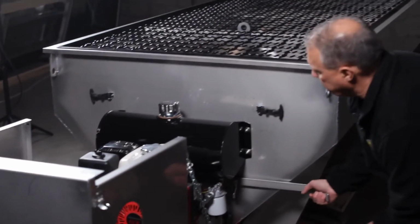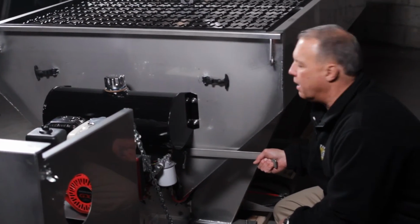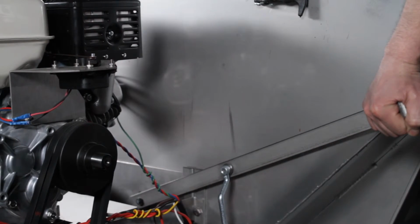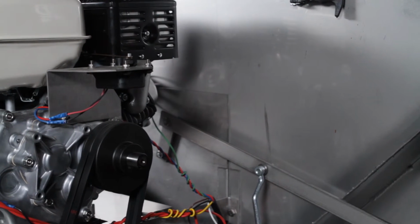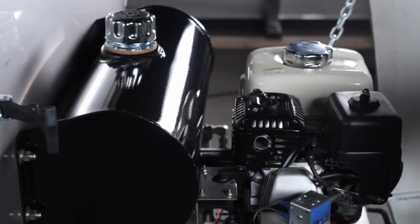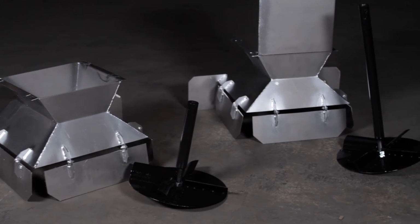As part of the hopper assembly, we include an adjustable gate to the rear of the hopper. This allows for just a release of the lever nut and an up and down motion to either close the gate for less material flow out the door to the spinner disc or open the gate for more. Included on all of our Economizer models, except for the Hydro Spread, are hoods that protect the engine, gas tank, or hydraulic tanks on any of the units so that sand and foreign material don't get inside or poured on top of the engines.